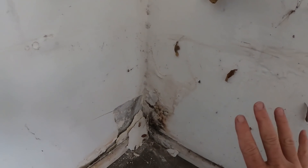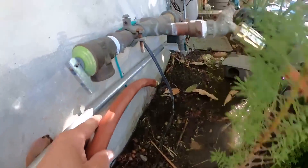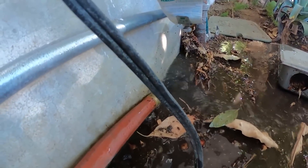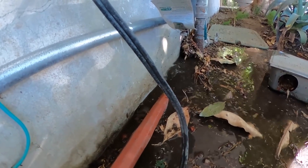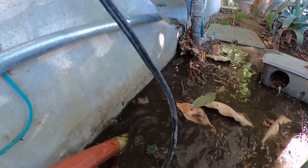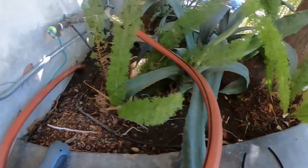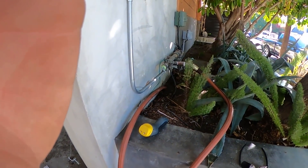Here's the mold. You can see the drywall is compromised right here. I'm going to go ahead and run some water because I think this is the suspect area. We'll let water run like this to the outside, then we'll start opening up the drywall and base molding. It may take 20, 30, 40 minutes, or an hour for seepage. We always like running water before opening up the materials. You can see the soil is pretty saturated — let's see if this is the cause.